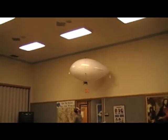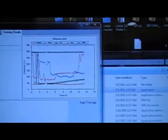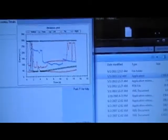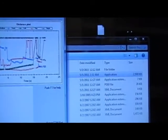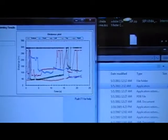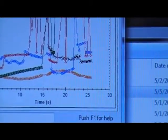We have to be careful, however, to run the ultrasonic sensors one at a time, in quick succession, to avoid the ultrasonic wave of one sensor being received by a different sensor. These same sensors can be used to map out the interior of a building. When the ultrasonic rangefinders aren't busy scanning for an imminent collision, they store the distance between the blimp and any nearby walls or large objects.